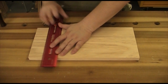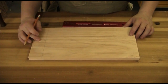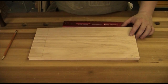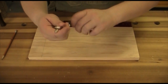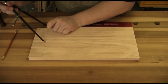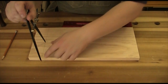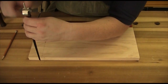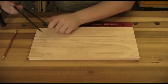No big deal. Okay? Now, how they did it is this is now 2x of what we want the length to be. So if we find x, we can go 3 times across and get our total length. So what they used to do is they take a pair of dividers. Dividers don't require much math, and I will change the setting up. So I'm going to set one line off, and then just walking down this line, I come over. And I come over here, you see I'm quite a bit over on this side. That error, because I made 2 steps, is twice my error. So I just cut that in half, divide it back down, and then I walk it across again.